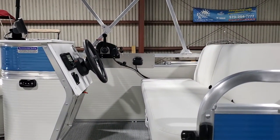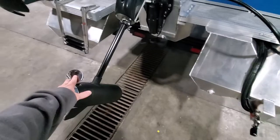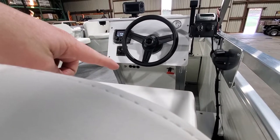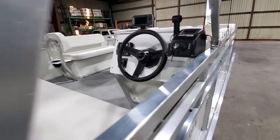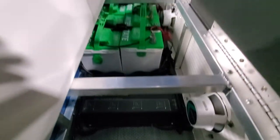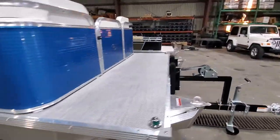That remote mount is located right behind our E-Drive controls. The E-Drive system itself is a two-horsepower equivalent electric motor. I have a 50-amp disconnect plug and also a negative disconnect on the helm. When you shut off the negative disconnect, everything in the boat is killed. When you unplug the E-Drive itself, it reduces any and all electrical draws, so your Minnkota precision charger works at peak efficiency. If you leave the house with this plugged in and you're out of town for an extended period, you do not have to worry — it will keep your batteries conditioned and working at peak performance, elongating their service life.